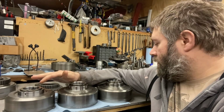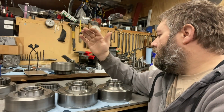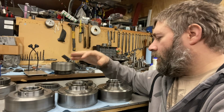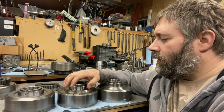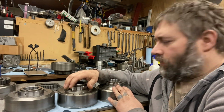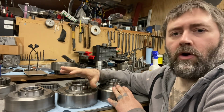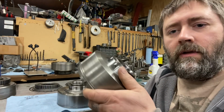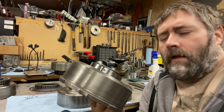And then as far as smoothness, they all came out to about point, or at, 6 Ra. And that was with 180 grit that I was finishing up to kind of clean the races. And that's exactly what the stock race on the 4L80E was. So machining those down, there's no worries. And then the only different thing I did on the Turbo 350 is I did put the one lube hole in it, where the one I got from that company didn't have any lube hole in it.